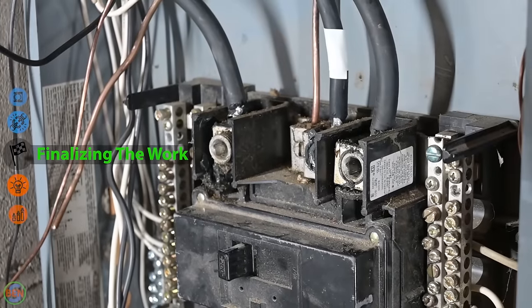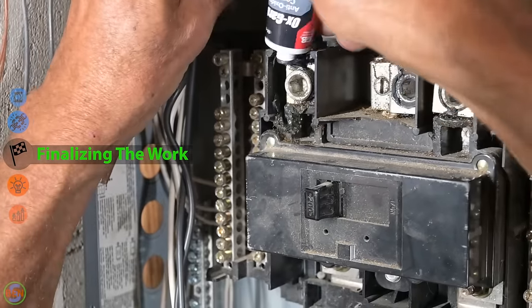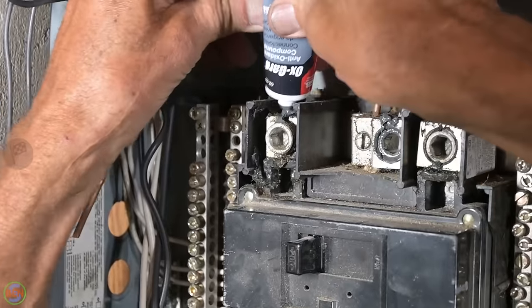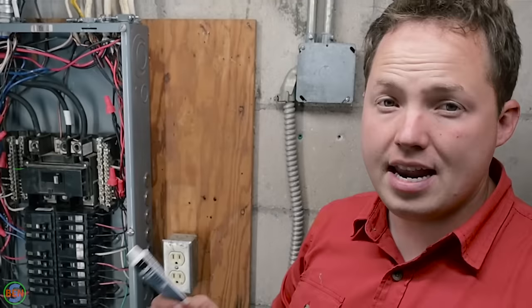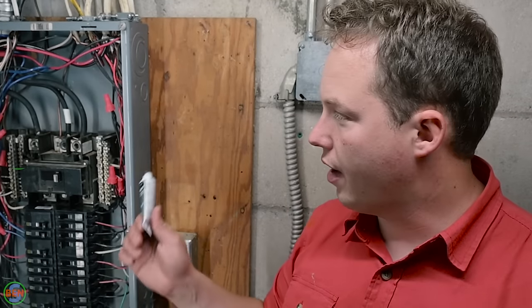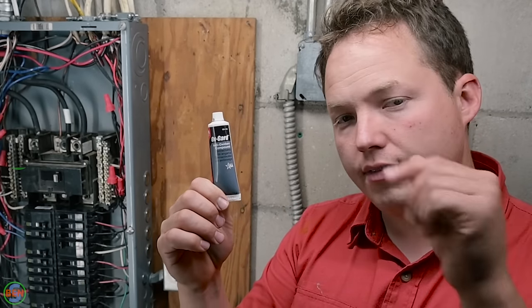If you have any aluminum service entrance cables or feeder cables that come into your panel, you're going to want to use an antioxidant to prevent corrosion, loosening, or heat problems as time goes on at those connections. So make sure that you use that where needed. I'll link this stuff in the description.